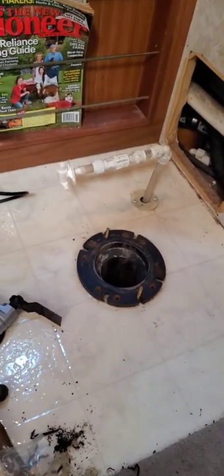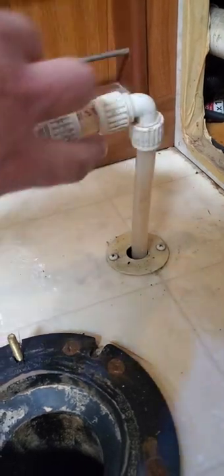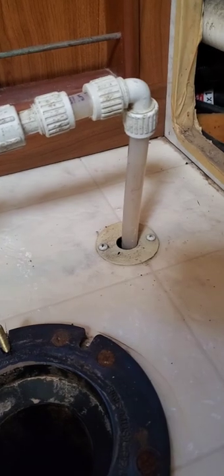That seemed to work. I've got the flange bolts on there. Now I've got to replumb the water because it comes in on the opposite side with this toilet. That was successful — I got it mounted to the flange by drilling and cutting it into a little slot, and then I rerouted the water supply with a SharkBite fitting with a valve on it — a faucet connection all made up from Home Depot.